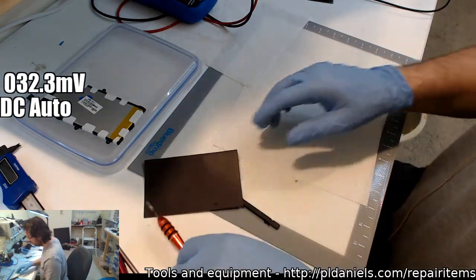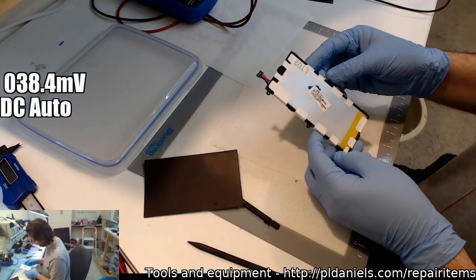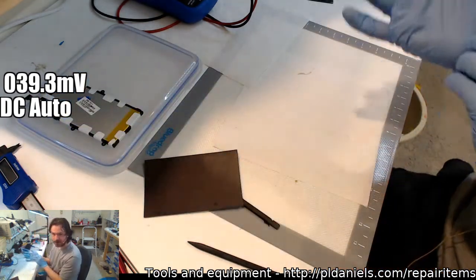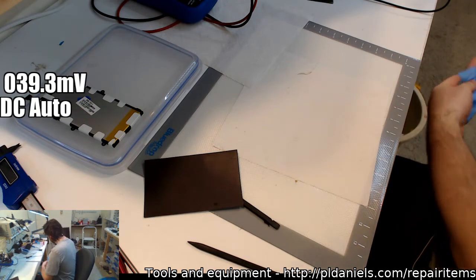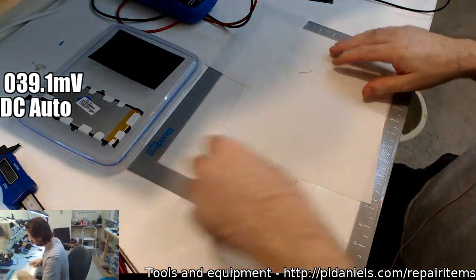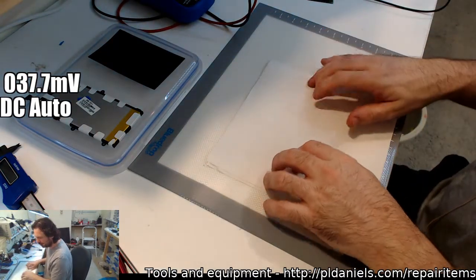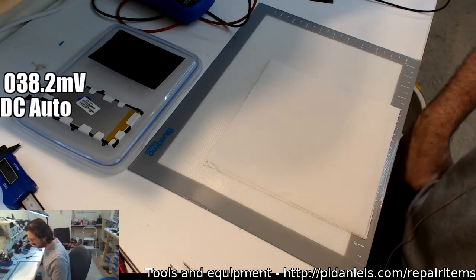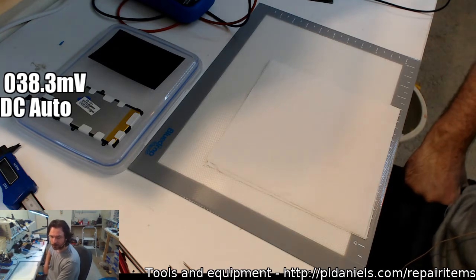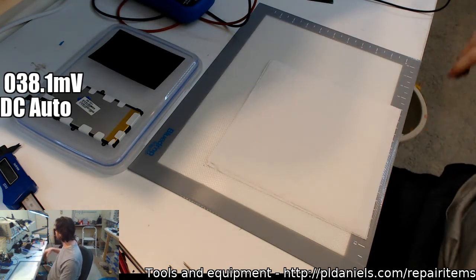Well, it can't be electronics in these ones, because that one read out all right. But I know usually if they get below 3 volt, that's typically when the protection circuitry will jump in, since technically lithiums shouldn't get below 2.75, and you still want to charge them. But between 2.75 and 3, you can do the trickle charge on them safely. Usually around about 1/10th rate, or is it 1/20th rate? I can't remember. It doesn't matter. And then once you're above 3 volts, you can go to your 1C rate. Not 1 amp, 1C. So whatever the capacity is, say if it's a 3000 milliamp hour battery, you can go at 3 amps, in theory.